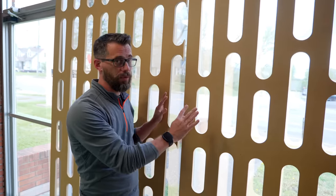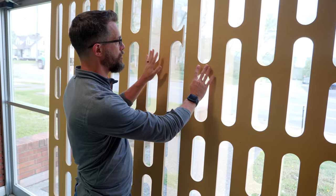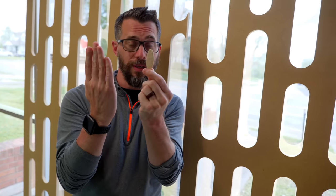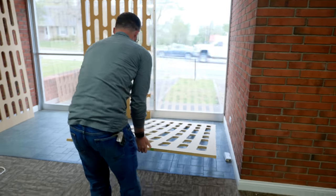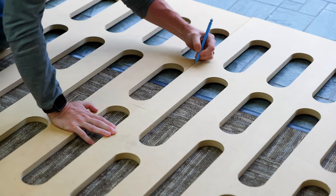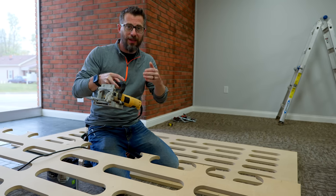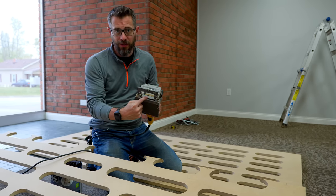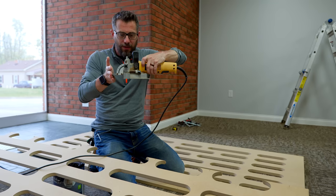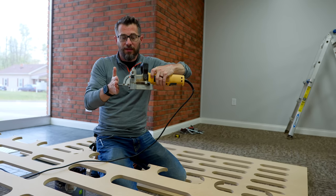We've got the first set of panels cut from the CNC. These are the fixed panels — they're going to be mounted against the wall and will not move. The thinner panels on this side are going to move. We need to attach the two panels together at all of these different little connection points, and to do that we're going to use a biscuit joiner. This is a tool that cuts a slot in two pieces of wood where they make a butt joint. You put a little thing called a biscuit in between them and it helps align the pieces of wood. You line up your two pieces, make a line across them, and use that as your center point. This tool is spring-loaded — you line it up, make sure it's flat, push it together, and the spinning blade inside cuts a slot then backs itself out.